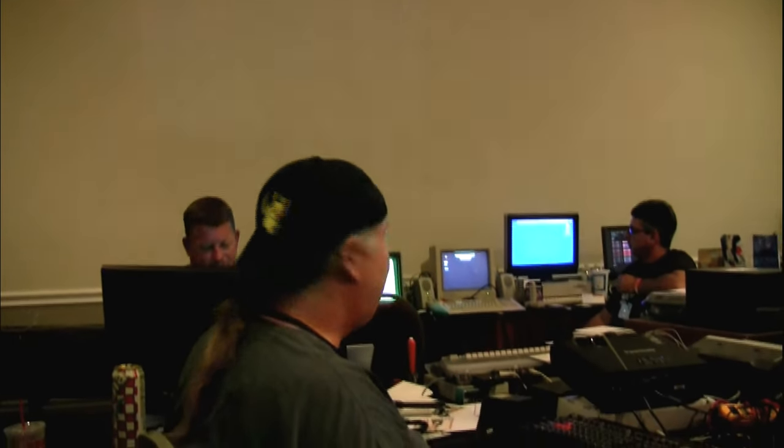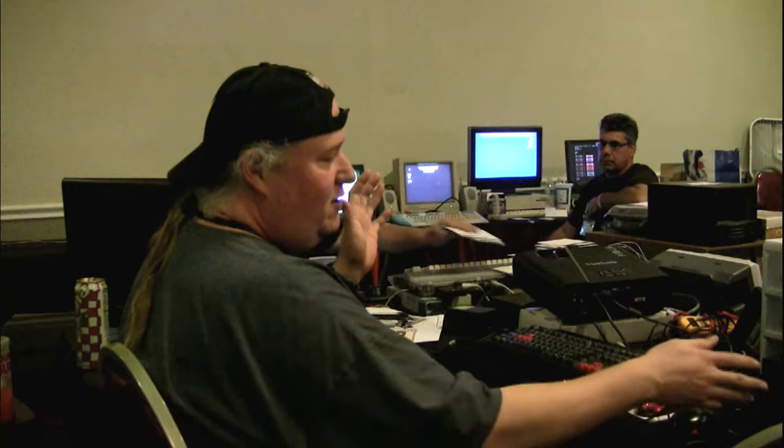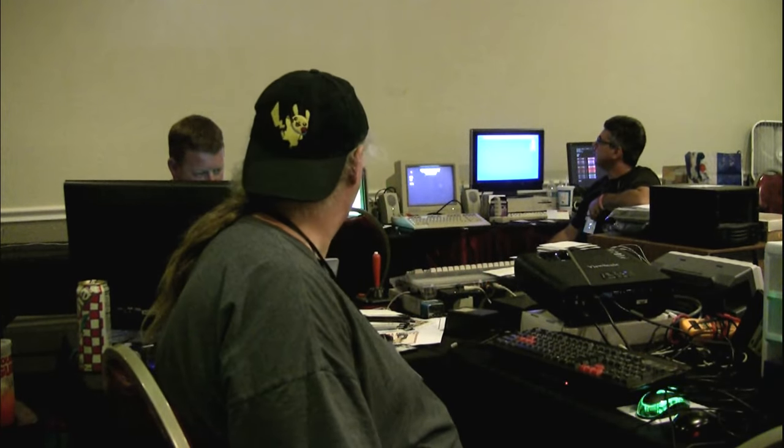And of course, there's a flag or a configuration to enable the composite port if you want to run this through the composite out. Basically, the composite out just takes the internal buffer, the 1920 by 1080, and downscales it to NTSC. So there's no resolution change. So it has an HDMI port and a composite port out. Yes, it's got both.